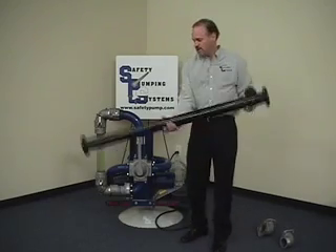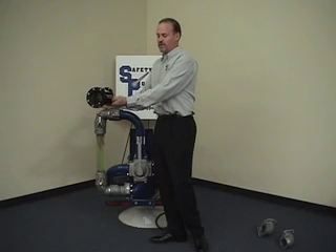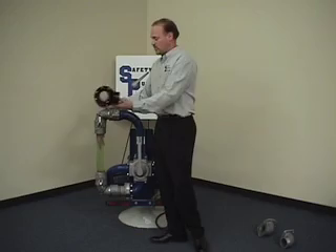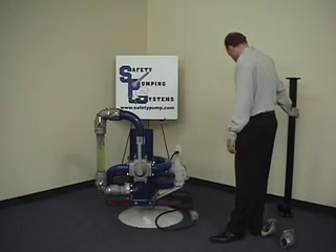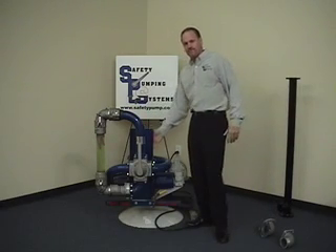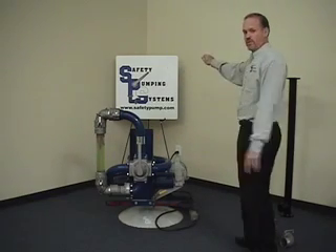The standard manifold goes from the left to the right side of the truck, pressure tested and powder coated, 54 inches long. This makes it so that you can load off either side of the truck with a gear pump or a vane pump. We have the brackets and all related hardware. Under a normal application, the truck frame would bolt right here, the cab of the truck would be approximately right here, and the passenger door would be right here.